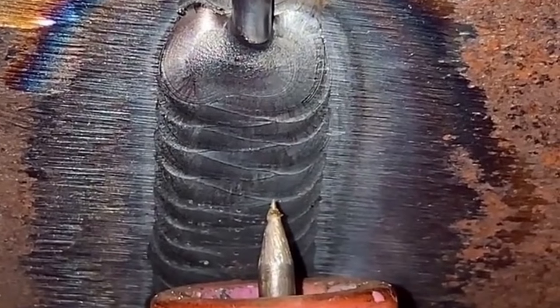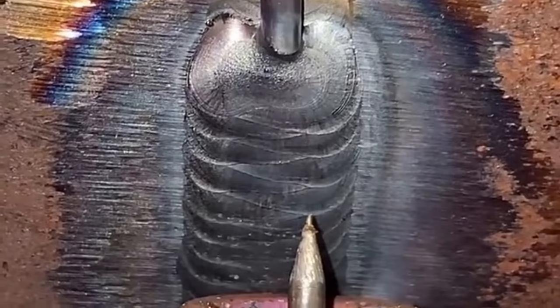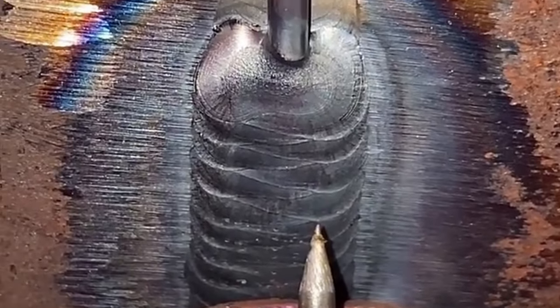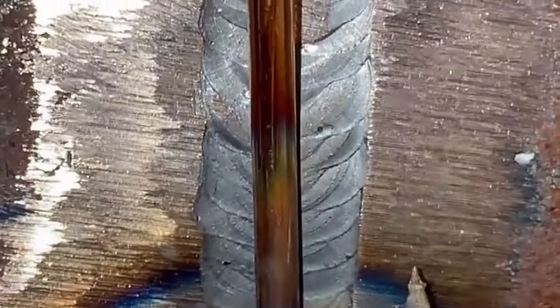This video is about the 5G carbon dioxide cap welding. When capping with CO2, we usually choose to start in the middle. The 5G cap width is roughly based on the width of the weld bead. For example, the height of our filler weld should be lower than the base material by about 0.5 millimeters.